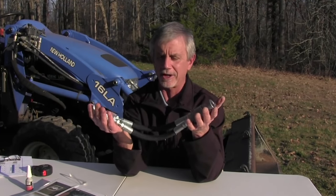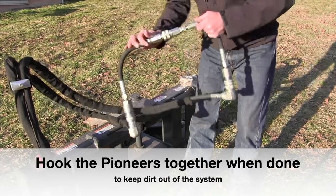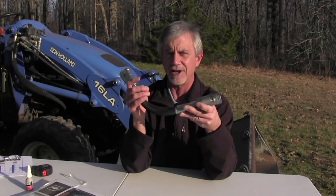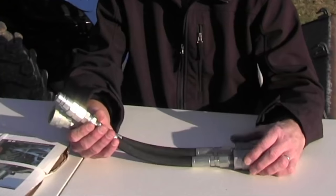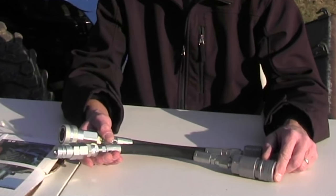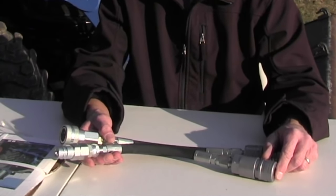I think if you'll try this trick it'll work. The flat face couplers are fairly expensive, but the pioneers are not, and the short piece of hose isn't either, so it's worth it to have it. The other thing these adapters do is let you go from flat face coupler implements to pioneer implements just by putting them in the system. It gives you more versatility when borrowing attachments from your neighbor or renting them — you can still plug them into your tractor. It gives you the best of both worlds.